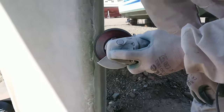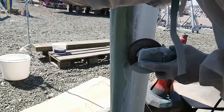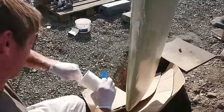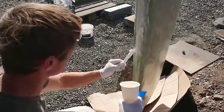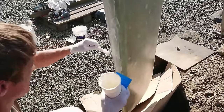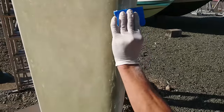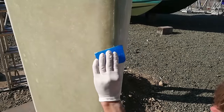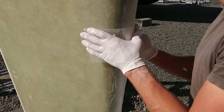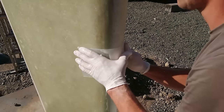While I was wrapping the rudder in fibreglass matting I already added several layers of fibreglass onto this leading edge to try and build it up and increase the angle of the curve, as originally it was a very flat profile and less than optimal. I've already built the leading edge up some more and allowed it to cure, and now I just need to even that curve out. I continue to add more thickened epoxy here as I'm trying to increase that angle even further. As the size of the curvature narrows from top to bottom I can't easily make a template, so I've simply used a flexible sheet of plastic and keep it squeezed to the sides as I slide it down. This does a really good job of keeping that curve angle nice and even as the rudder tapers towards the bottom.